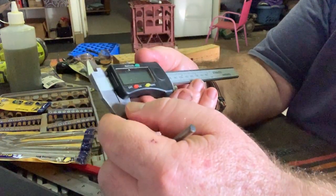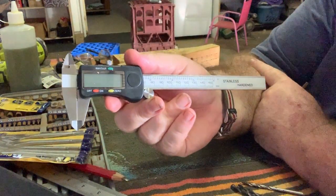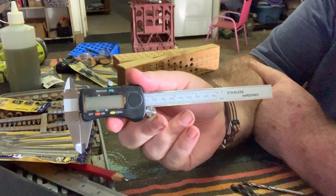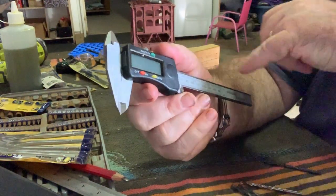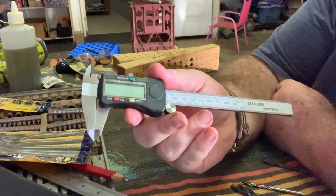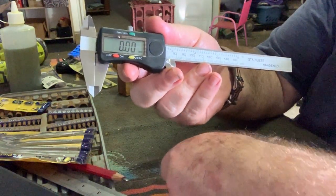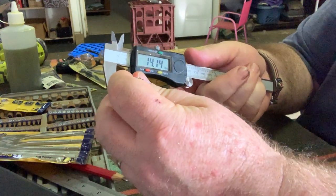At the workshop they were using a simple micrometer, but I've managed to pick up a digital vernier caliper. These can be used for measurements up to one hundredth of a millimeter — the micrometer goes to one thousandth of a millimeter, but I really only need a tenth, so this is more than accurate enough. Now that I've got this one with its digital readout, I'm probably not going to bother with the manual one again. Turn it on, push it down, zero it if you need to, and then use this little dial to roll it back.